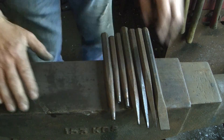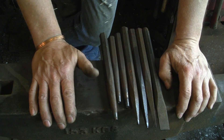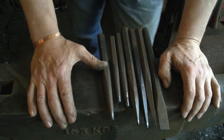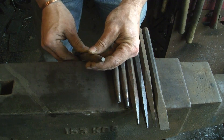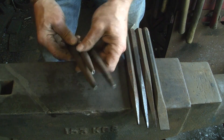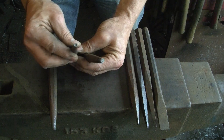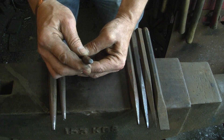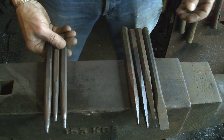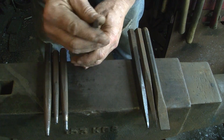Hi guys, I've had one or two people ask for some information on basic punches. These are the basic punches I use - most of them are for my shoeing work. I don't generally punch an awful lot other than that. These round ones I use for stud holes - three different sizes. I've got a big one for 3/8 studs, this one is for 5/16, and then this one is for 3/8 threaded stud hole, so they're all slightly different. And then these are my pritchells, which are for pritchelling out the nail holes.